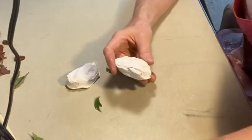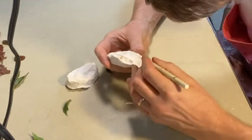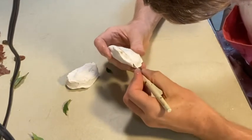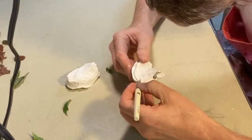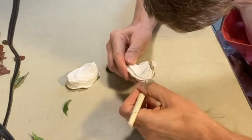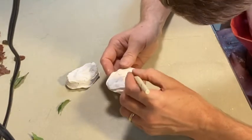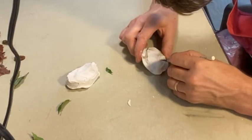So I'm going to make sure that I have a pouring cup, and I'm going to carve this out a little bit wider here. And I'm actually going to make a small hole at the bottom because this is so thin. I want air to flow out. Now you could make vents that went back up to the top. If you had a bigger mold, you'd have vents. You could actually put a few vents off to the sides too. That's where air can come out.